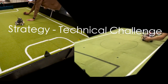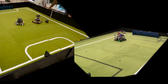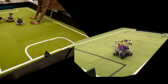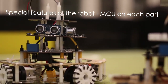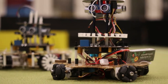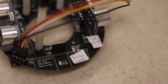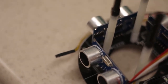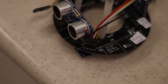Our aim in the challenge is to score goals as fast as possible. We use polar control on the motor and enhance its power. I2C was used throughout the whole robot. We spent a lot of time and effort on multiplexing all analog and digital signals into one I2C bus. Our solution is to add a microcontroller on each part of the robot — for example, an ATmega328P was added to the ultrasonic sensor ring for multiplexing four pairs of echo and trigger pins into one two-wire bus.